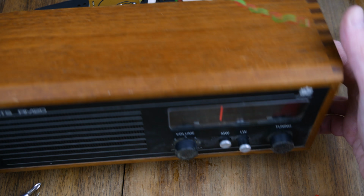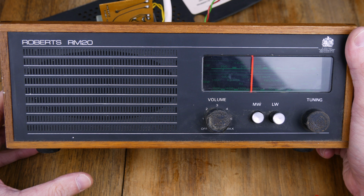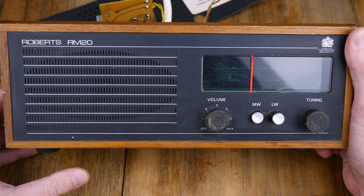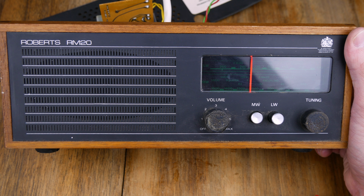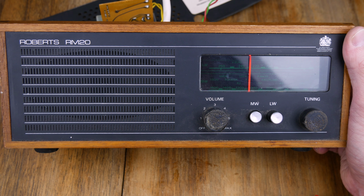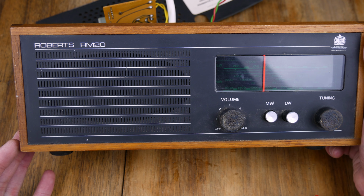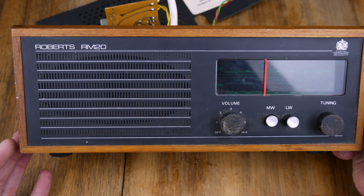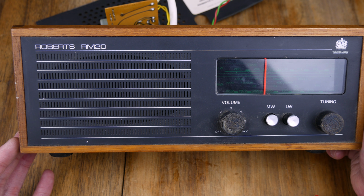Okay, well, I think that'll do for today, because I'm not quite sure where I'm going to go with it yet. I'm going to measure that power supply, and I'm also going to give it a bit of a load test and see what kind of current it will kick out. I don't think it's going to give me the 2 amps at 5 volts that I need, which is maximum. So let's say I'm using a Raspberry Pi, I want it to have some kind of peak current ability, and I don't think that power supply is really going to cut it. So we'll go for something a bit beefier.